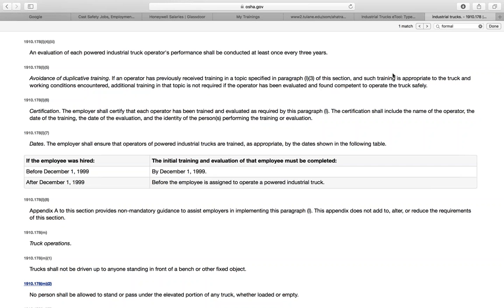Also, our personnel safety of riggers, like we're talking about, and things that we want to do on the job. We always want to read and follow the manufacturer's recommendations for any type of equipment that we're loading. Also, the recommendations provided for any type of startup checks or periodic inspections. We also want to determine the weight of the loads. We want to include the rigging, the hardware, anything that may be attached to that load. That's going to go into those weight capacities as well.